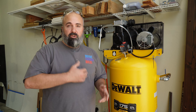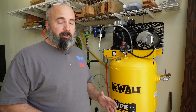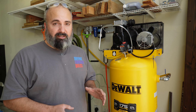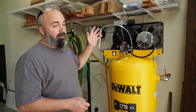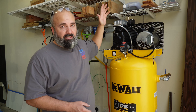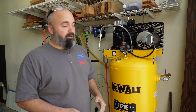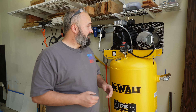I think this is going to make a big difference in the operation of this unit, the longevity of my tank, as well as the longevity of my tools that don't want water in them — such as when I'm powder coating, sandblasting, or using any of my air tools. I think this was a great upgrade, well worth the cost and investment in time. You could go get these lines made up by a hydraulic shop out of stainless steel braided line. You do need the upper line to be temperature-rated — at least 300 degrees, probably more depending on your environment. This made a big difference. I hope it's inspiring for you to do something like this. It's fairly simple and entirely worth it.